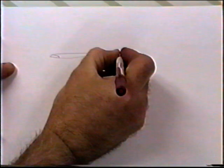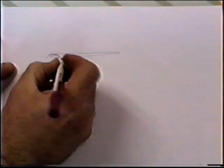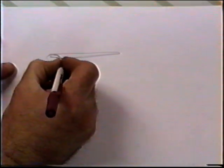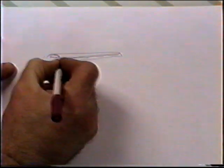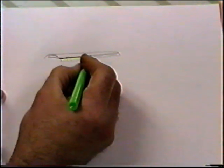Now, one of the ideas that I've had right from the very beginning, I was making up these molded shells, and even the first effort I had at doing it, what would happen is when you'd mold a piece over the top of this, you never could pick up this line where the mold ended. This line was always a very vague thing. When you'd mold this shell, this piece would be oversized, and picking up this line accurately so you could drop this down on the fuselage side was really a problem.